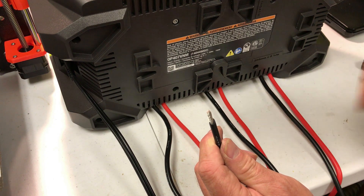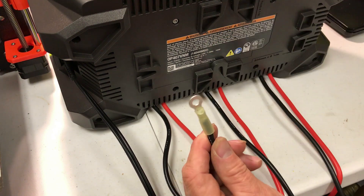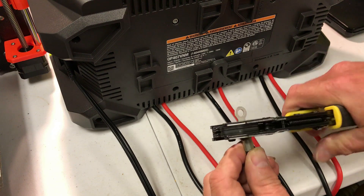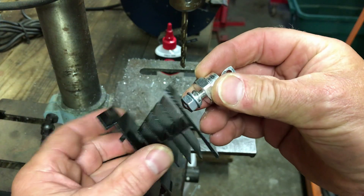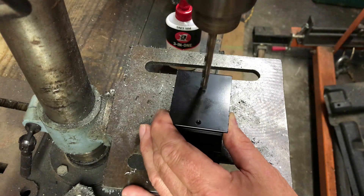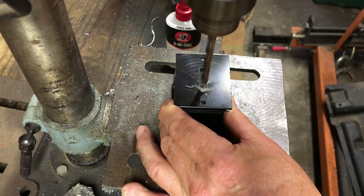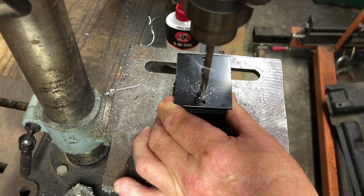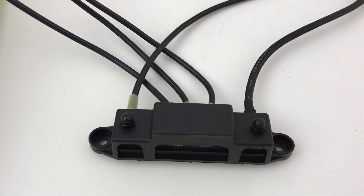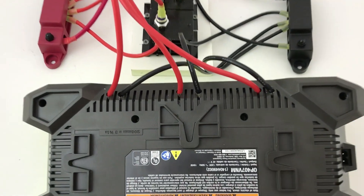I'm stripping the negative wires and putting on ring connectors. I want to mount the blocking diode in this heat sink so I'm going to put two holes in it so I can mount two blocking diodes for the heat sink. I've connected the plus batteries to the blocking diodes and then to a connecting strip, and I've connected all the negative lines to a connector strip. Now we're at the point where we could hook one to three 40 volt batteries up and have 40 volts out.